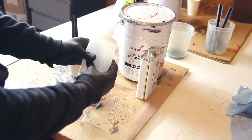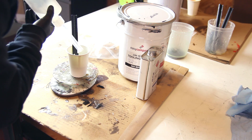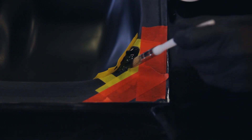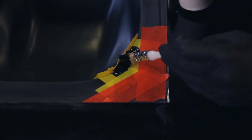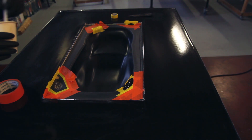It's advised to use around 2% wax. In this cup I have 50 grams of tooling gel coat — always use the same resin you used when making your mold. I've added 2% wax, which would be around 1 gram, and then 4% MEKP hardener, because these are small surfaces and I have enough time to fix everything. I mostly use a brush to dab into all the little holes I've created, building it slightly above the surrounding surface so I can sand it flat with the rest of the mold area.